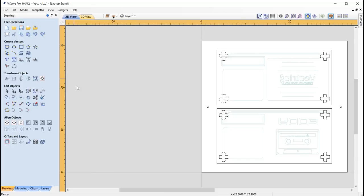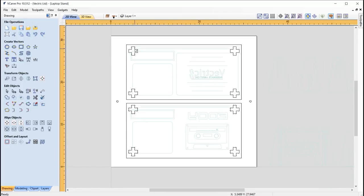Okay, so let's just jump straight to the other side here. You can see how I've laid this out. We've got the leg slots in each corner of those two tabletops, and then we also have two circles here that represent the diameter of some dowels that I've got knocking around that we're going to use in order to machine all the way through the material and into the spoil board. They're placed symmetrically into this job, so I know that I can just flip this over and put them back in to the dowel holes that are drilled not only through the material but also into the spoil board as well. And I know that I'll have a correct alignment in terms of the X and Y locations when we come to flip that over.